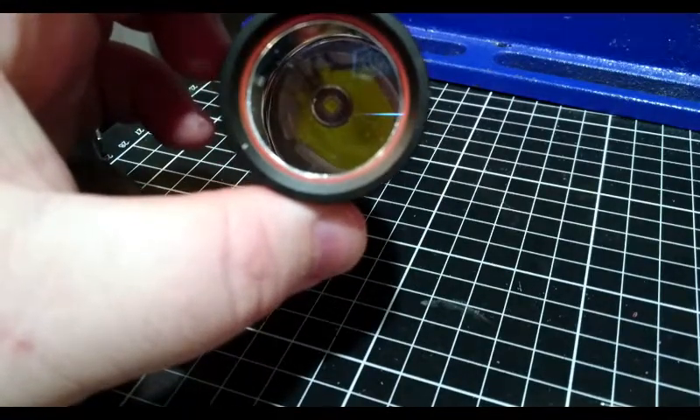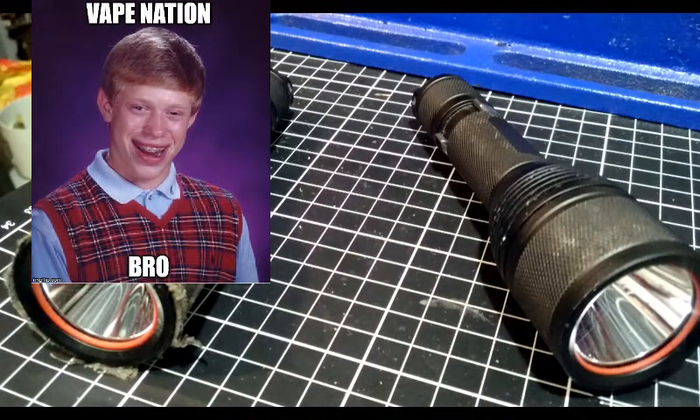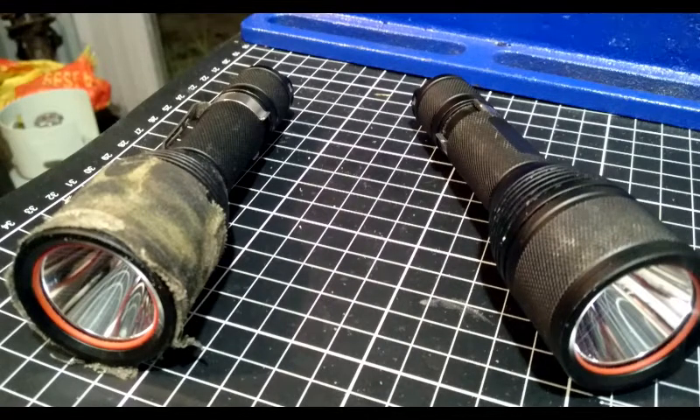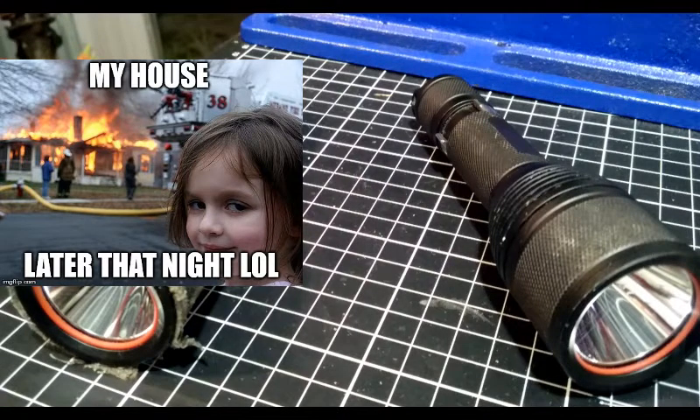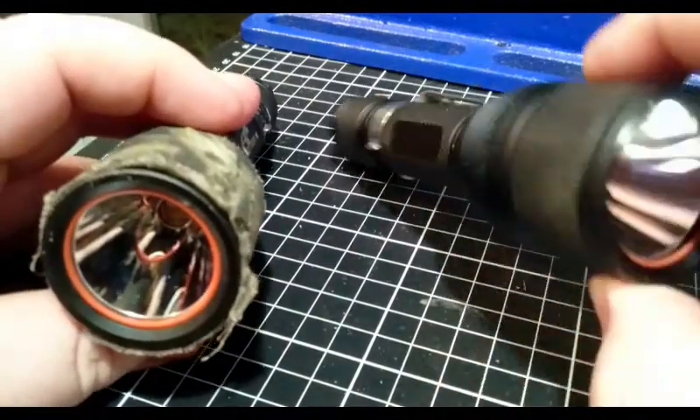So that's the SST-40 there. When I hooked this SST-40 up, it actually started smoking. I'm not sure what was going on there. It could be because it's too hot, or it might just be burning off excess flux or thermal paste. It appears to have stopped now. I'm not too concerned with that because I've had LEDs that smoked before and they've lived for a while. Eventually they will burn out faster because you are running too much current through them and they're not dissipating the heat fast enough. But I don't think that's happening here because it's on a proper direct thermal path board.